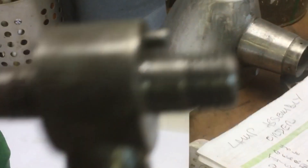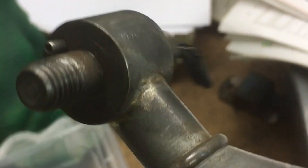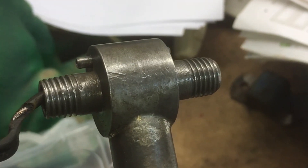Right folks — you can see here how they're put together. They are in fact brazed. This piece is turned on a lathe with these two threads machined into it, and then it's brazed onto a tube with a hole drilled through it to get the cables through. Isn't that incredible. God, how much would one of these cost to make nowadays. Bye now.